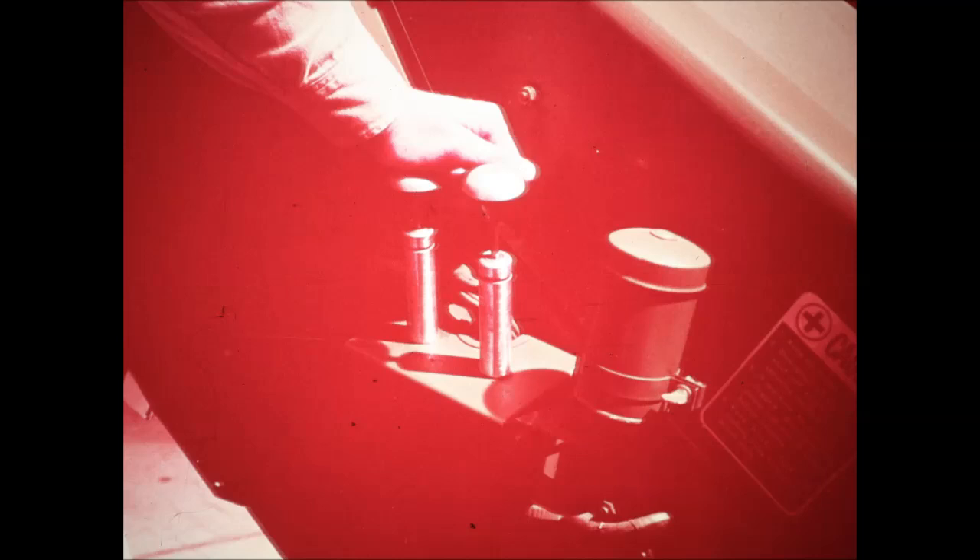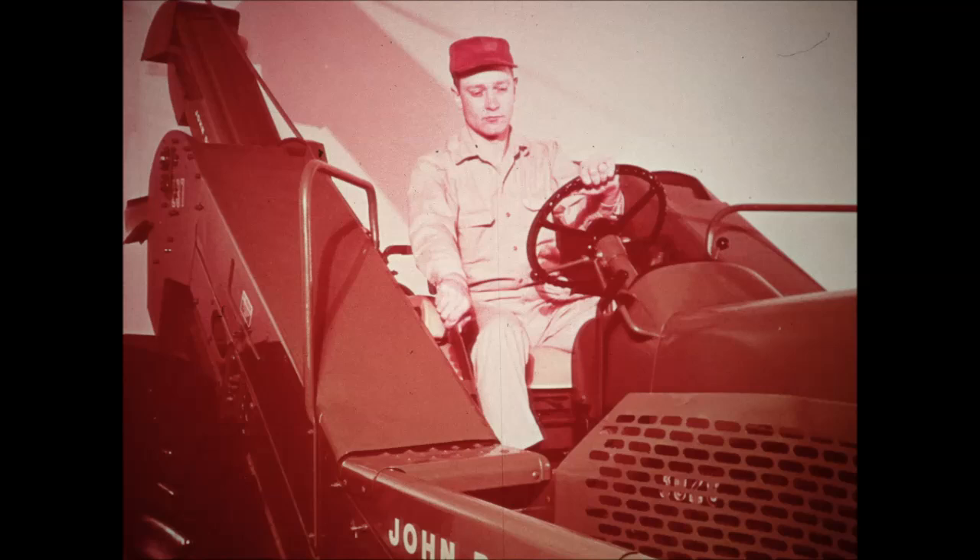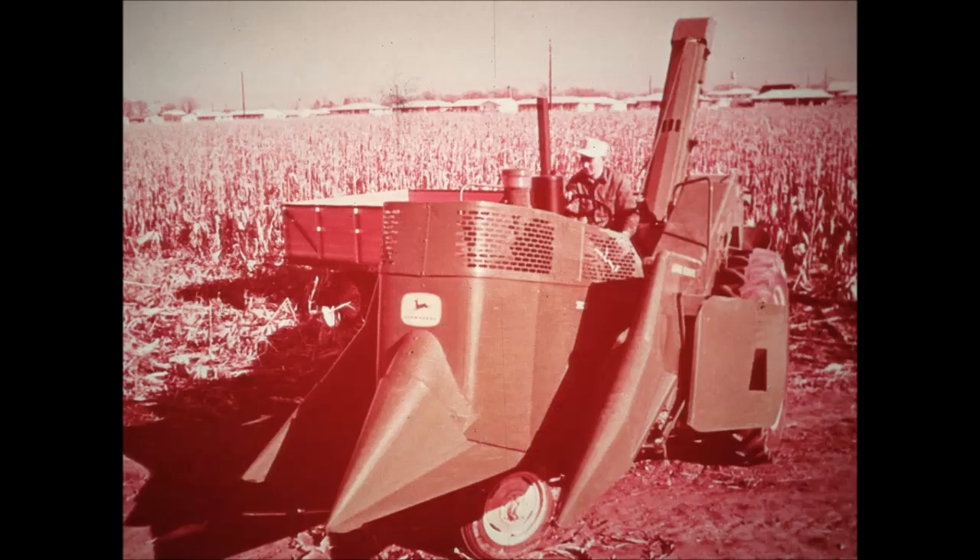You don't spend time finding, cleaning, and greasing fittings — with the handy multi-luber, you grease as you pick by pushing these plungers. Snapping rolls are adjusted from the tractor seat; a lever for each row unit offers individual adjustment to meet conditions. High lift raises gatherers 27 to 30 inches to clear front wheels for tight turns and crossing gullies, and helps make servicing easier too.